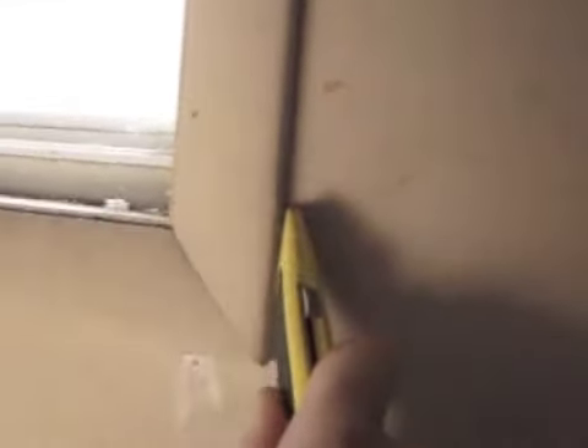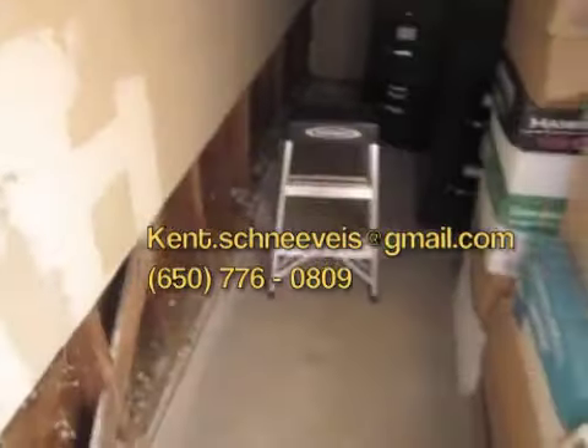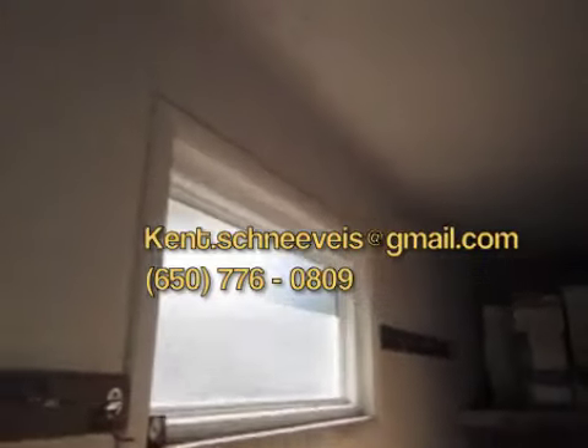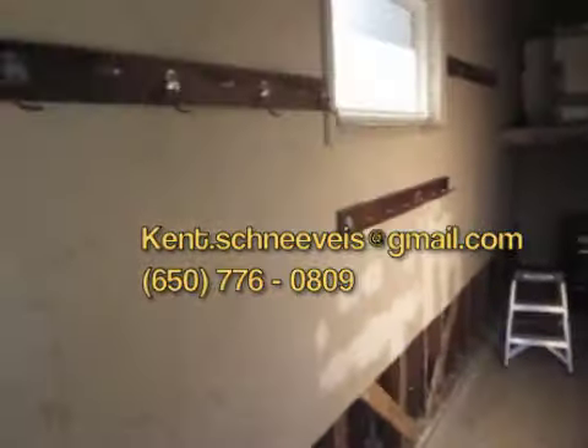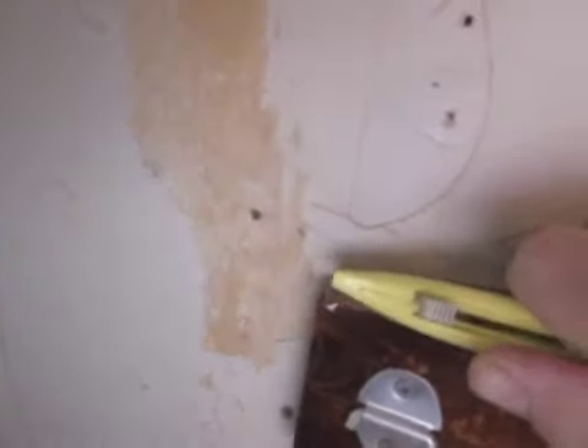Just like so, just zip along with a nice fresh blade and come up to here. We're going to leave the sheetrock behind these hanging racks because we're still going to want to use these. There should be a note that once the sheetrock comes off, the homeowner has decided to leave the sheetrock off the wall. So this wall will have no sheetrock — it's just a garage, we don't need sheetrock in here. That's why we're cutting around here like so, and it's going to leave this little bit behind.